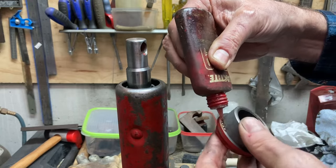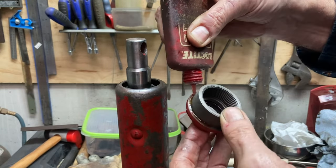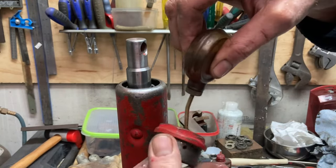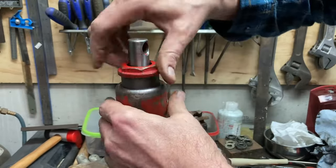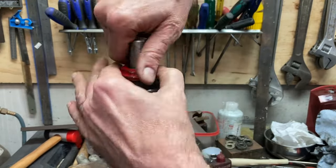Gasket under this head flange. I'll just put a bit of hydraulic sealant around there just to stop anything leaking out, because this thing's going to be sitting at a constant 45 degree angle. So it may actually have oil sitting up in the head there somewhere.